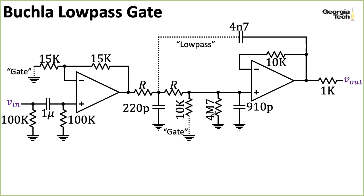We only need to worry about that when the gate connection isn't being made, because otherwise we could rely on this 10K resistor. So for most of what follows, I'm just going to ignore this 4.7 megaohm resistor.